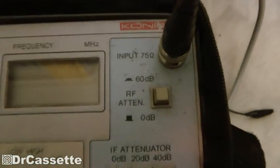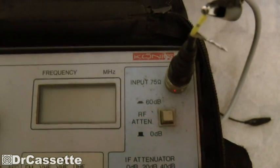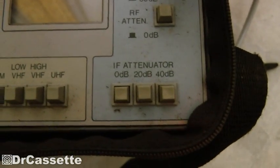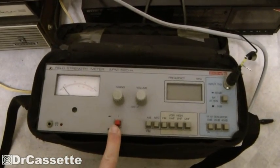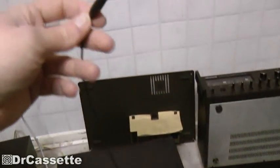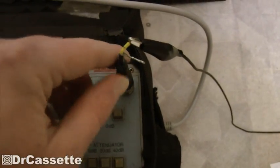Here we have four really good antennas. We have an RF attenuator for either zero decibels off or 60 decibels. We have an IF attenuator — I'm not sure if that's for even stronger signals or something else. For the demo we're going to use this well and truly ridiculous little antenna: just a small clip-on wire and an old BNC plug.